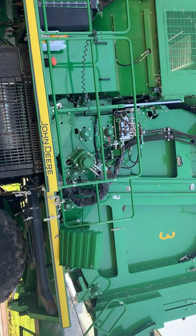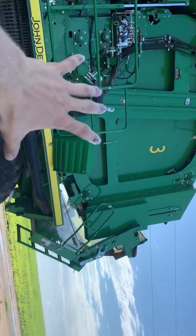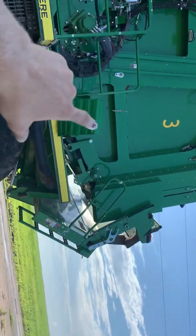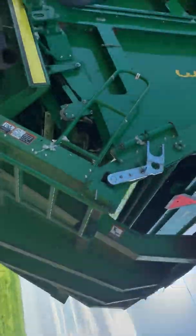The cotton goes from the accumulator into the bottom of the baler where it's baled. Once the sensor hits 94 inches, it'll wrap it. Once it starts wrapping, there are rolls on the back — it'll hold five rolls, one in the chamber and four up top.